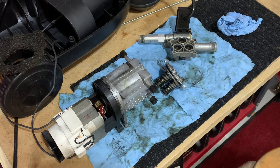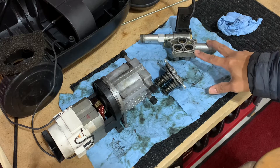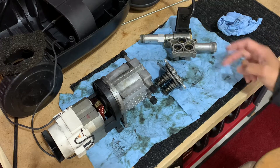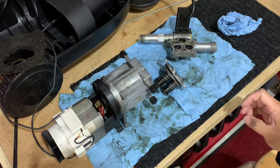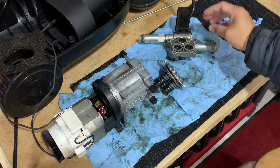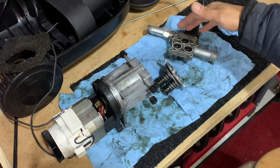Here's the engine and motor of this pressure washer — I pretty much just took it apart. As you can see the different components here, we have what we call the head part of it. It's basically a three-cylinder head, and here are the actual pistons and rods with spring-loaded pistons that push the cylinders to produce that pressure, as you can see here.